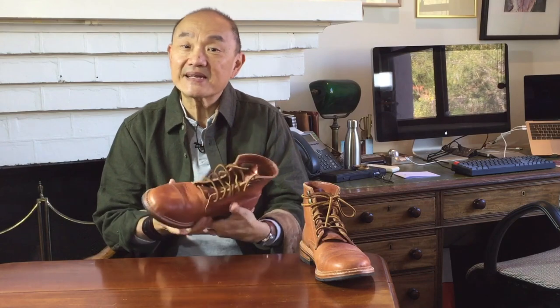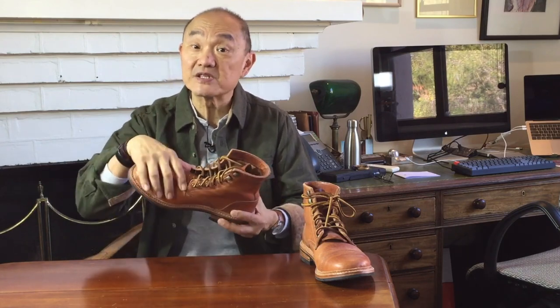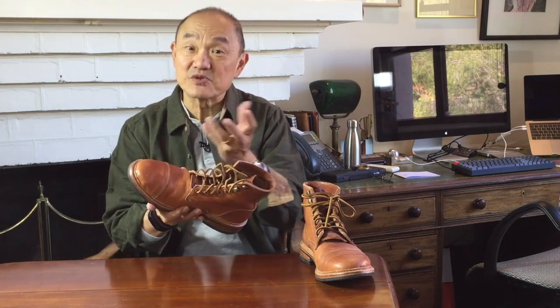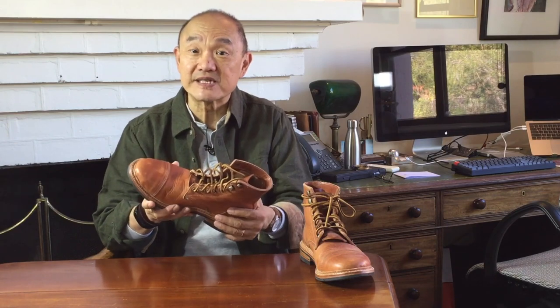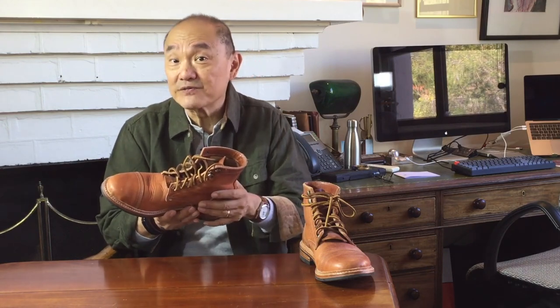The advantage of hand lasting is that a person can exercise greater control over the manipulation of the upper's leather, responding to its unpredictable stretching and folding characteristics. And hand finishing a pair means the bootmaker can apply some individual thought as to how things are made as it's being made. Disadvantage is that it's obviously slower, hence more expensive, and it can lack uniformity.